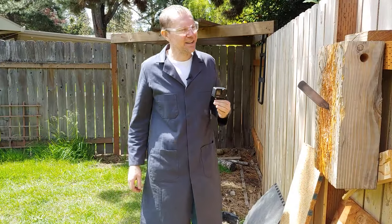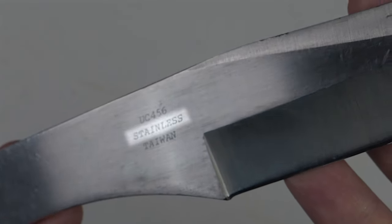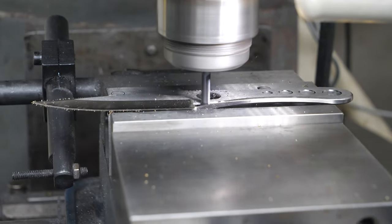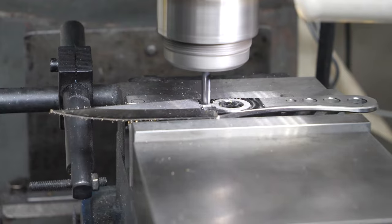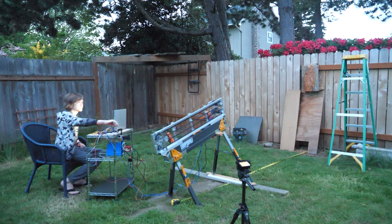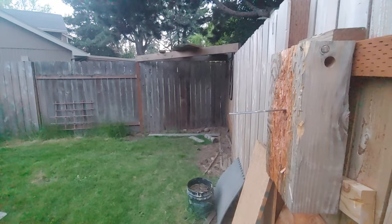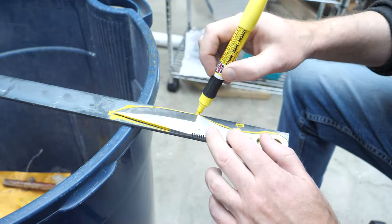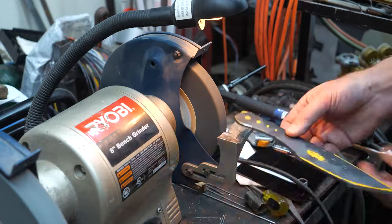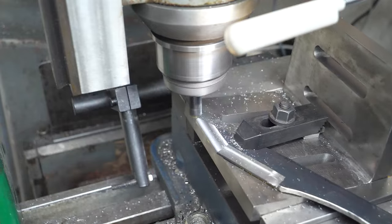Okay, so we've proven we can throw a hunk of bar stock, but I want to throw the same knife as the Navy SEAL in that documentary. Some of you are going to say, hey, magnets don't work on stainless steel, but not so fast. It depends on the alloy and how it's heat treated, because a magnet can grab these knives, sort of, but also has some difficulty letting go. Bottom line, we got it to stick once, but it was so inconsistent, I think I'm just gonna try making my own knives out of the same mild steel I used the first time. Yes, it's a terrible choice for knife material, but it's cheap and already in my shop. If it works well, I'll invest in some tool steel or spring steel instead.